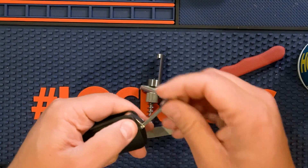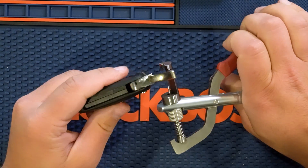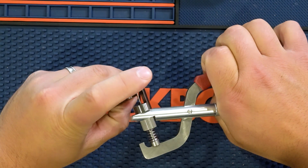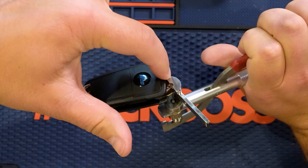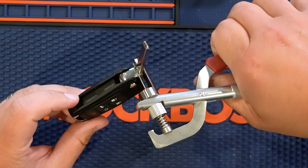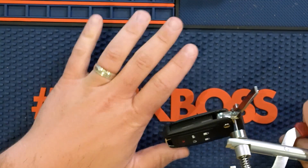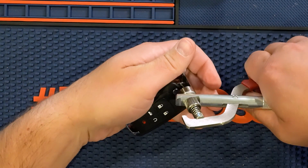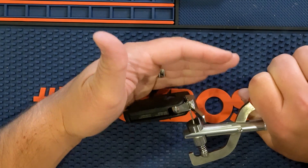You can, if you ever need to, just carefully take something like Houdini and spray it right down in there. The first thing you want to do after you have the ejector pin on there is go ahead and get it lined up and get it in place. So we're going to hold it like that. You can see there's a spot where the pin can come through. I have it perfectly lined up with the actual roll pin right there. It's always good to have something underneath you because sometimes that pin can go flying — you can even kind of put your hand there.